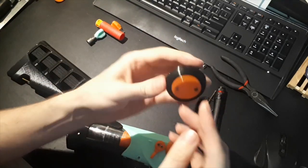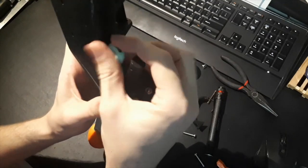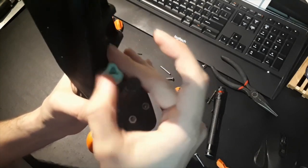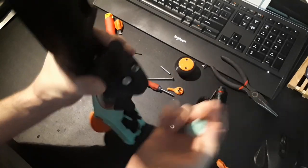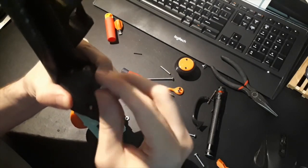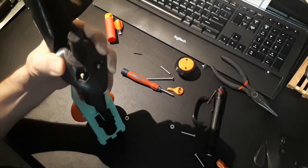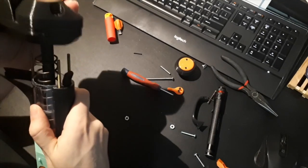Now this will slide off — there's the priming handle. This orange piece is just a decorative cap held on by two screws. I can use a socket to get these nuts off the back. I'm holding this piece down because when I get the last nut off, the spring will want to shoot it backwards. Slowly let that out and now I can take off all of that.